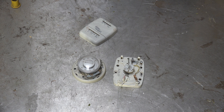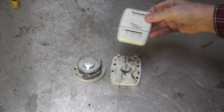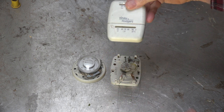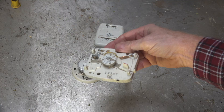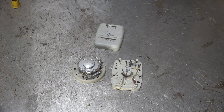Can you calibrate a mechanical thermostat? Electronic thermostats — sometimes you can put offsets in the software — but mechanical thermostats are not always accurate. These things have two components: one is the temperature sensing element, this little bi-metal here, and then the other one is the actual thermostat itself, which is also a bi-metal coil right here.